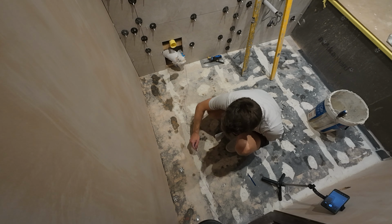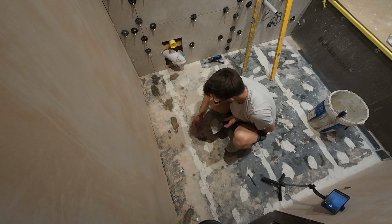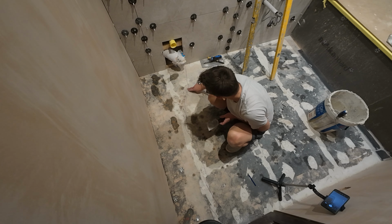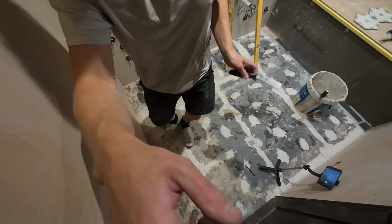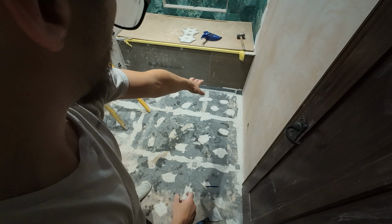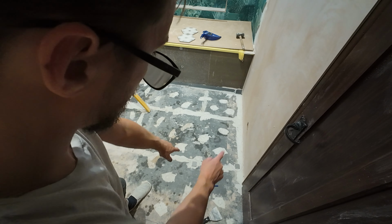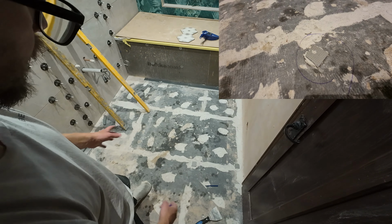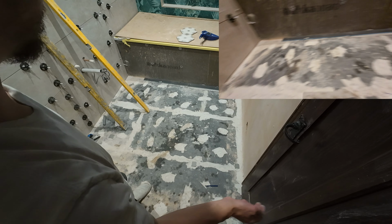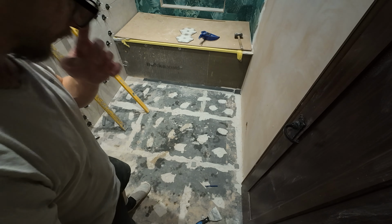And now we have a line, or a squiggly line I should say, where the floor's obviously up and down. So yeah, we know round here it's going to go from nothing to filling up the rest of the floor. So I've got my level bit at the back, so I know I've just got to go to that, and that's all good. I've got my guides dotted around the room now, so now I can knock some self-leveling up and start chucking it in and filling it up, and we should have a nice flat floor.